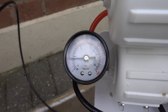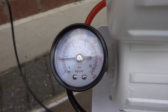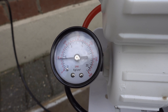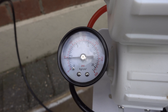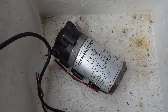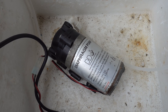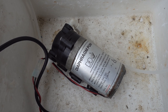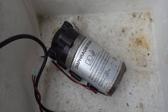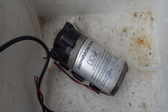The third factor is water pressure. If your water pressure is low you've got less input going through, and this seems to reduce water production. As you can see mine's at about 50 psi. We'll also do a test later on around what production is like with or without an RO pump. This is the pump — a DD pump. All you do is plug in the connection from your water into the pump, then that goes straight into the RO machine. You do need to plug it into electricity, which is a bit of a pain if you're outside.